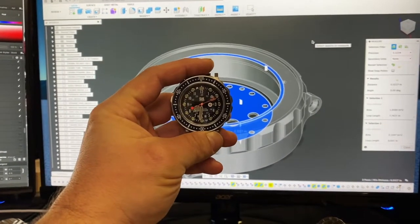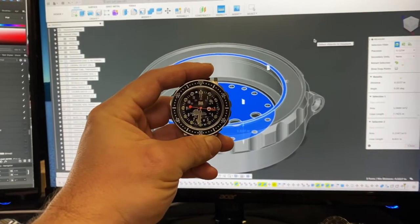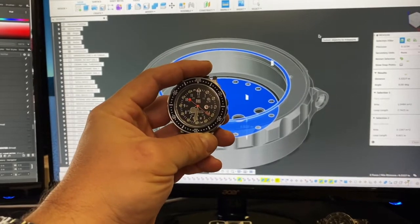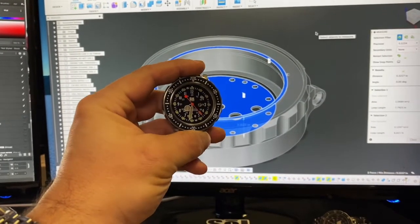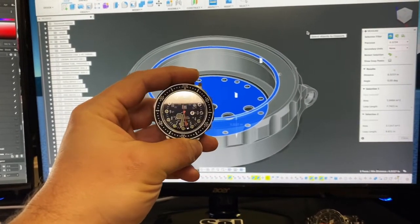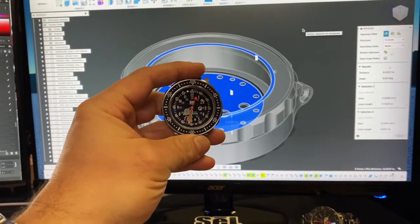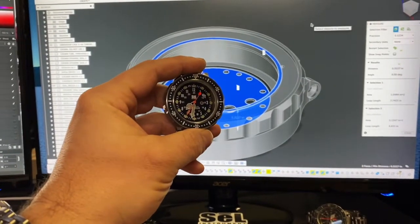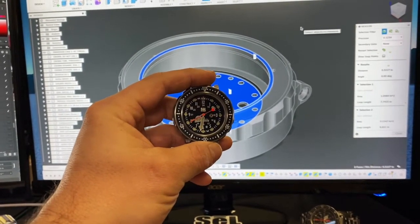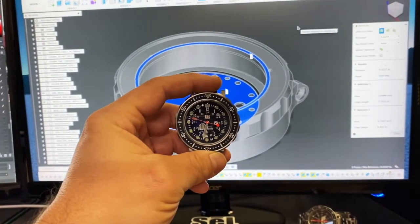The visual issue came up because when we look at a watch like this one and ask 'is this insert marker aligned with the dial marker?' — well, you can see that position changes because of perspective, because they are separated by a distance. When we look at it from the side you can see that 323 thousandths of an inch separation, and if I move it this direction the upper triangle shifts to the right of the lower triangle; if I move it the other way, the upper triangle moves to the left. There's actually a second factor in this: stereoscopic parallax.